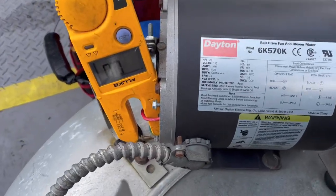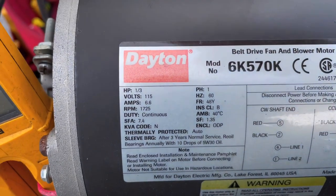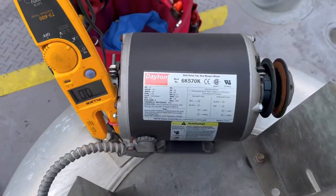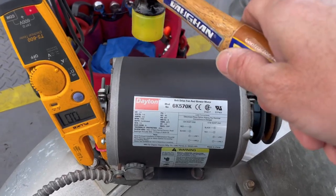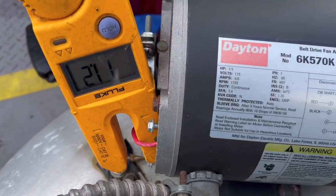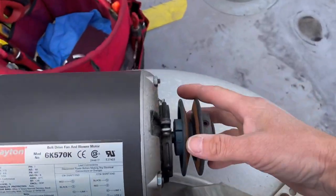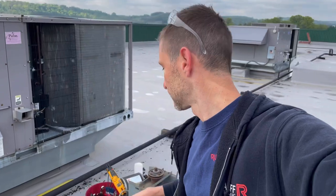I was able to put my meter on one of the legs in there. Now it says 6.6 amps. So if we go above that 6.6 amp range, that's bad on the motor. We currently have power on, motor's not running at this time. We do have power, but I believe there's a dead spot in the motor. 11.3 amps — we are definitely locked up. Let me turn this power off. The motor is bad, everybody.